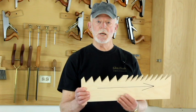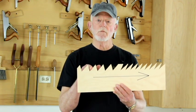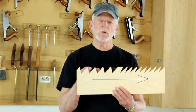That depends on the species and the dimensions of the wood you're working. More teeth does not necessarily mean better results. A little tooth and a big tooth both cut exactly the same. So the real difference in pitch is in the size of the gullets. The gullets have to be deep enough to carry the waste from one side of the piece to the other so that gravity can dump it out. If they're not, then they fill up with debris and the saw feels mushy.